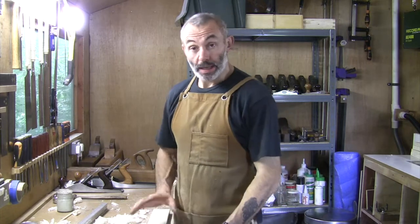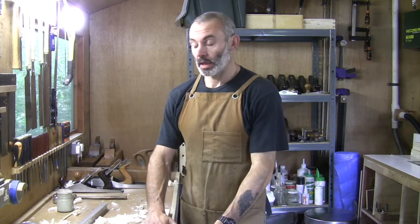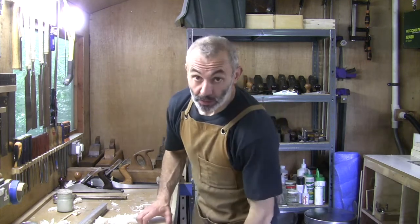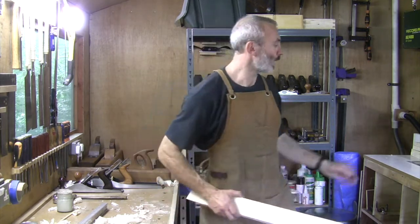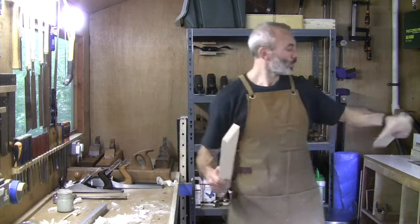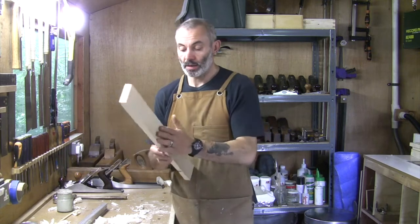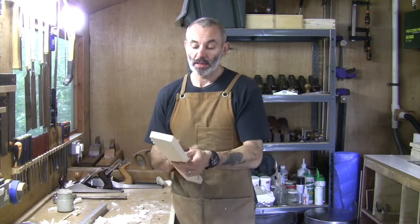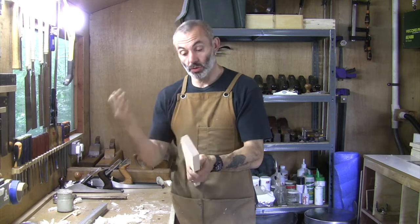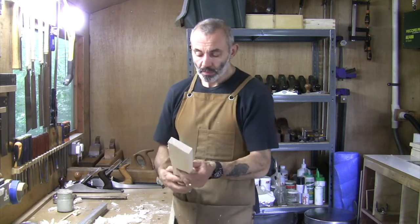Now just doing exactly the same I have done for the front panel, for the back panel, so jointing all the timber here. So right now at the stage of same thing, doing the flat face first, doing the face side, then I will proceed to do the opposite side first and then the two sides.